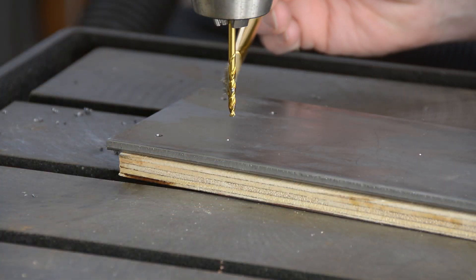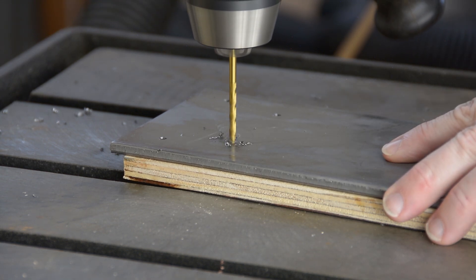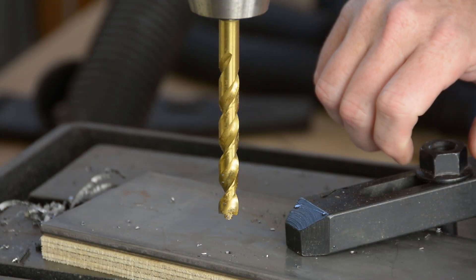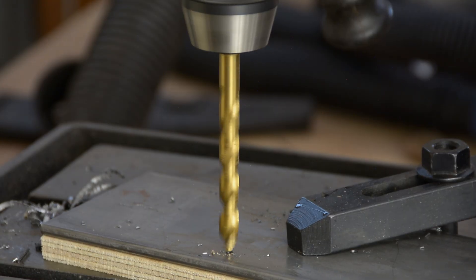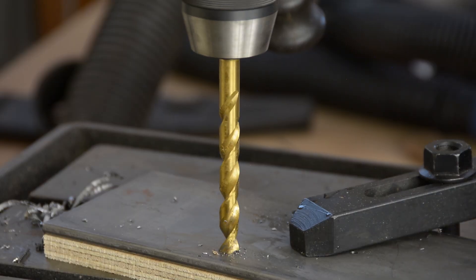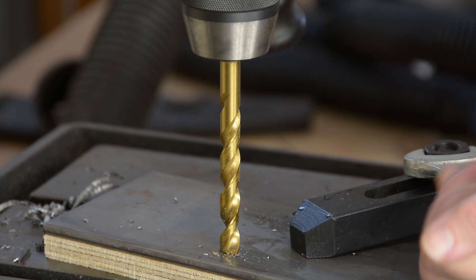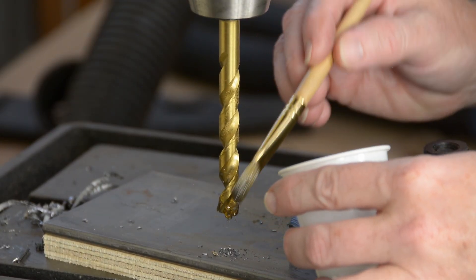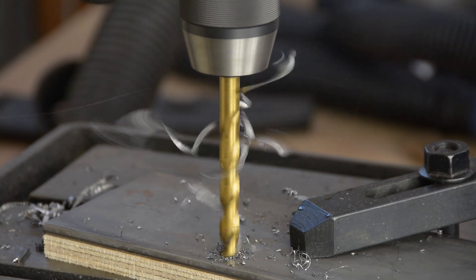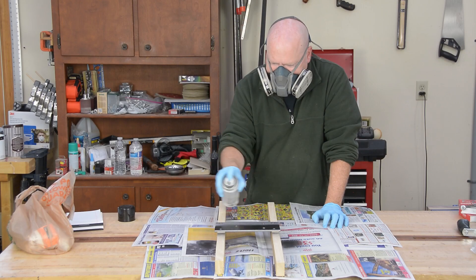There's some room for error in these holes, but drilling is just easier if you do it in steps. That lets you use drill bits sized so they can mostly self-center — the small bit in the punch holes, then the larger bit in the pre-drilled hole. Hand-tighten the clamp until the big bit pulls the workpiece where it needs to be, then stop and leave the drill quill down while you tighten the clamp. A sharp bit and the right press speed will give you long curlicues, which are fun and mean you're doing it right, but they're sharp and dangerous, so watch yourself.